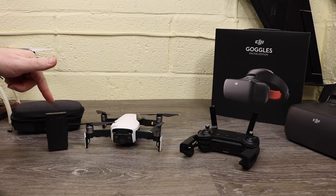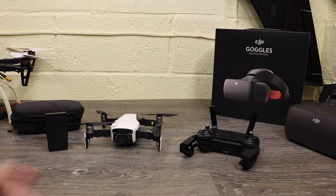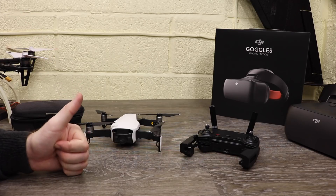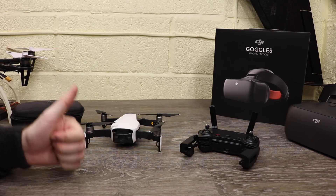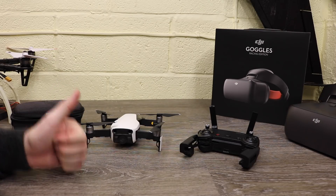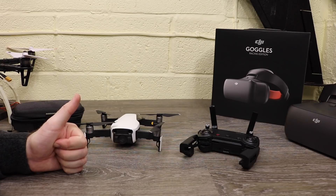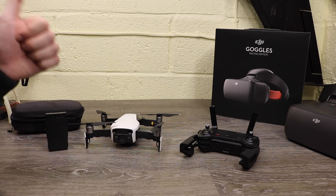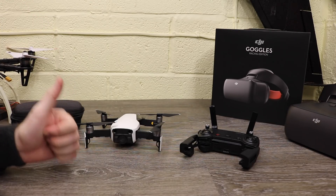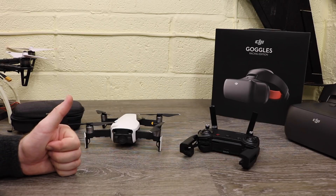The first thing I see mentioned is: what do I need to calibrate when I get my Mavic Air new out of the box? Number one, you do not need to calibrate the IMU. In fact I strongly advise against calibrating the IMU. Since DJI introduced the Mavic Pro they changed the way they do these calibrations at the factory and they are now done in a set of temperature controlled conditions. This means that you do not need to do it when you first get your new aircraft.